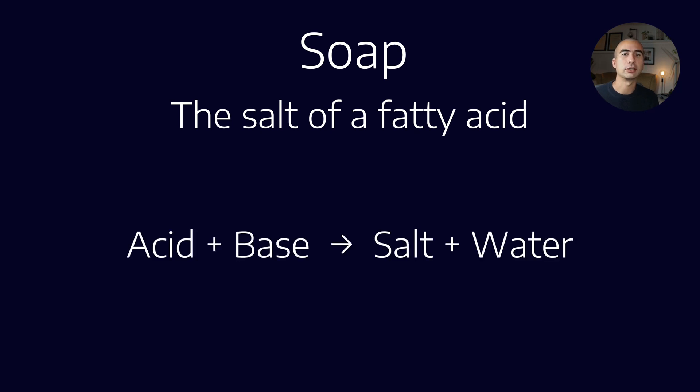Soaps are the salt of a fatty acid — we react an acid and a base and get salt plus water. The metal salt is the thickener. One thing to notice is that water is a by-product of the process, so during manufacturing we have to pull that water out of the final product. There is another version where we react an ester instead of an acid, and in that case the by-product will be methanol. Again, you have to remove the methanol before you can sell the product.